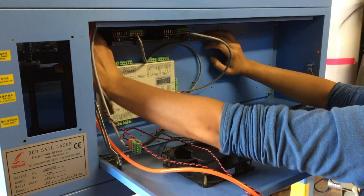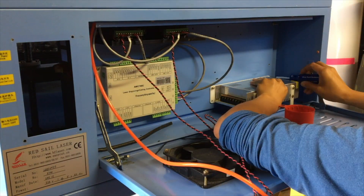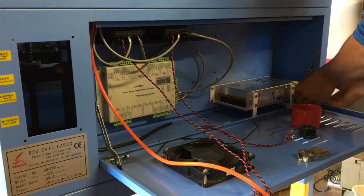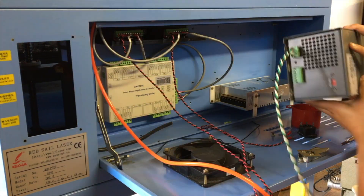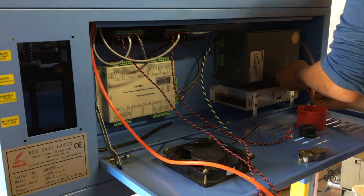The main controller more or less dropped into the old holes. I was able to use the old heat sinks for my new motor controllers, and I just had to make some little brackets and drill and tap some new holes to mount the power supplies.